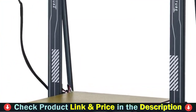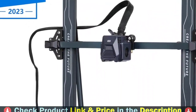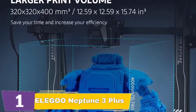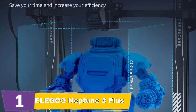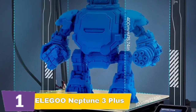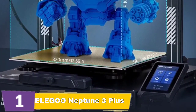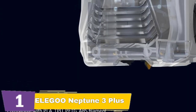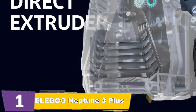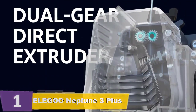The larger-than-average build volume of 320 x 320 x 400 mm (12.59 x 12.59 x 15.74 inches) gives you enough space to freely arrange your prints, print larger models, or carry out batch printing with high efficiency. The Elegoo Neptune 3 Plus adopts a non-contact high-precision sensor to collect deviation data at 49 (7x7) points of the hotbed, then automatically adjusts the Z-axis height to compensate for any irregularities and unevenness of the printing bed. There are also hand-twisting knobs underneath the hotbed to fine-tune the print bed with a single twist, ensuring a perfect first-layer print.